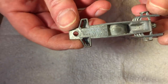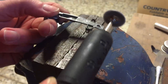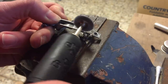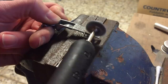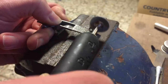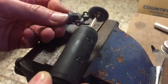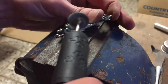Next up is the base. It used to look nice and shiny but over the years it got some wear. A couple of subscribers warned me about using the fiber pen as it would be too abrasive to clean up the casting. That's why I'm using a steel wool Dremel tool — it actually gives me a better result with less scratches on the base. After cleaning it looks much better, though I have to clean up some of the smaller parts by hand because the tool can't reach them.